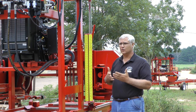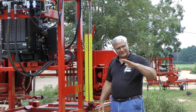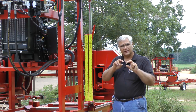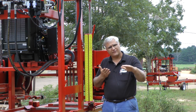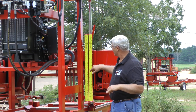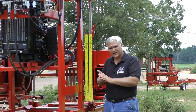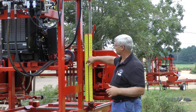As I mentioned, we have some scales that are actually set up so that if you want a full one inch board, you can drop from line to line, or number to number, and it will give you an actual one inch board or an actual two inch board. It takes into account — allows for — that kerf. The blade itself has to come out of that board, so all of that's figured into our measurement here. That allows you to just drop from one line to another without having to figure, oh, I've got a certain kerf from my bandsaw blade and I need to leave it an eighth — you'll just drop from line to line as you go.